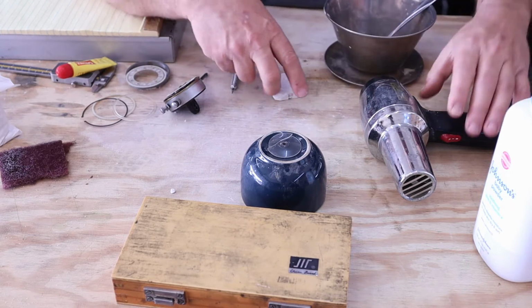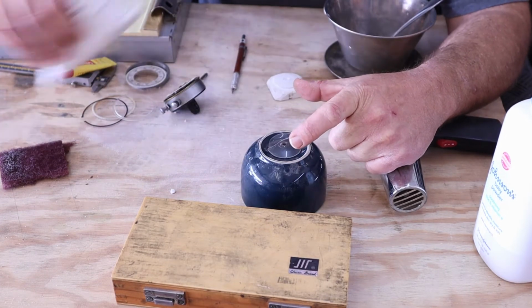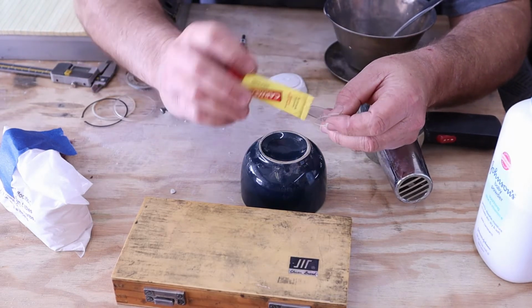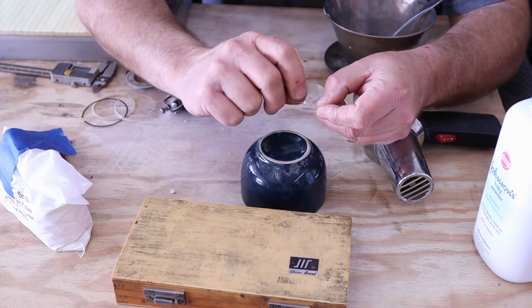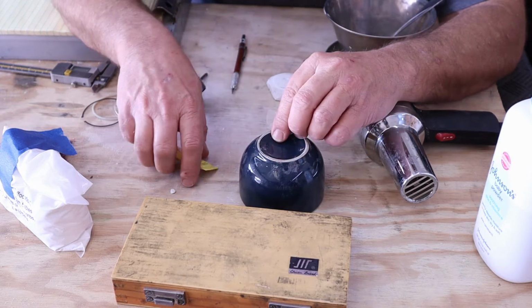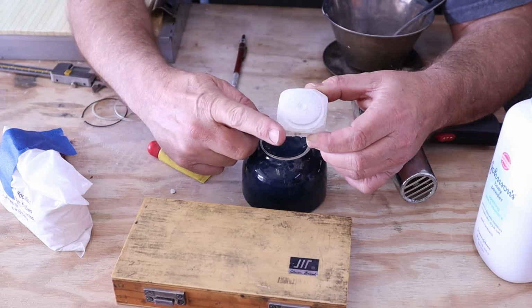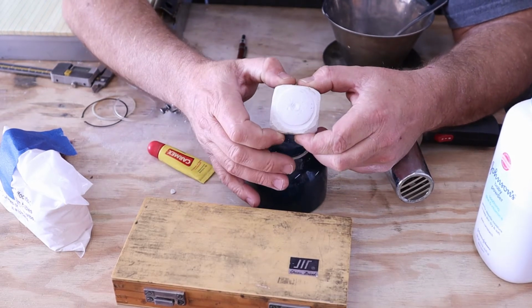Then I went to thinking about how I could do this. So I made a small box, and I poured into that box some plaster of Paris, and then I used Carmex, a lanolin-based lip balm, to coat the lens, and I pushed it into the plaster of Paris and ended up with a mold roughly with the shape of the lens in it and a lot of plaster on top of it. I used a razor knife to trim around the edges to where I could get a piece that I could work with.